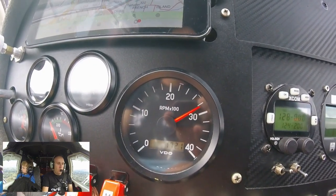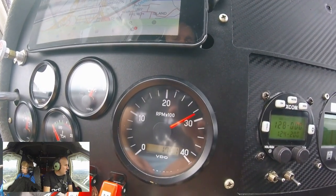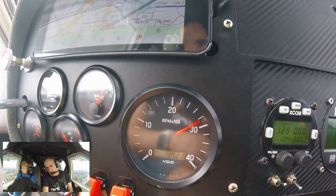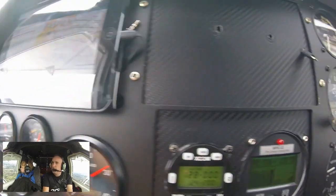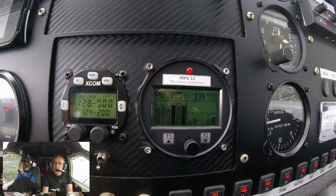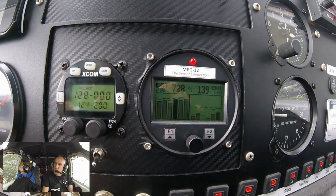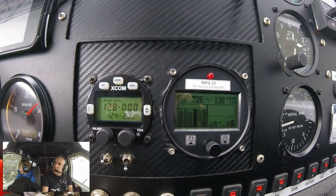The other thing that's happened is we've leaned up a little bit and the RPM has increased ever so slightly. I can both hear that and feel that — and based on the RPM it looks like it's gone up. So we're now sitting on around 724. Let's bust a myth around EGTs and CHTs being linked.